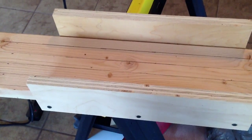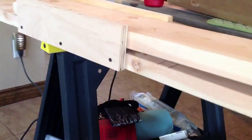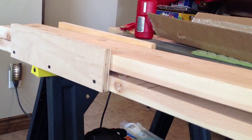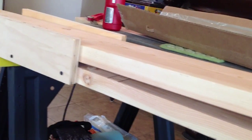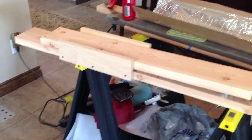The other thing I did is I created this trough — basically screwed on a couple of pieces of plywood. I'll throw the board up here so you can see. I apologize for the wobble; I'm operating the camera by hand today. But you can see the two by six fits in between here and I can adjust how it sits across the top. When you put the pipe in here, what I historically had a problem with is the pipe would want to roll around a little bit and come out not straight. If you put the pipe in and lay this down, then put the weight on the front of the pipe by the washers, the back is held straight and the pipe won't roll from side to side. That allows you to grab your clamps, tighten down, and not worry about the board rolling off one side or another. It works really well — I've been pretty happy with it.